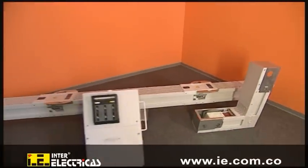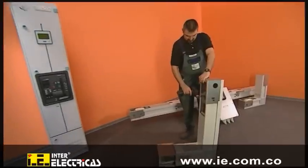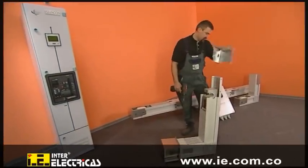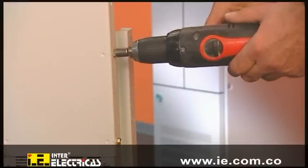The LD system is designed for power transmission to high current loads in industrial environments. The first step in the installation process is the removal of the flange cover and the protective cover from the trunking unit.